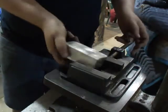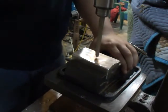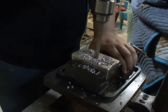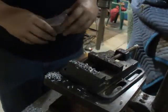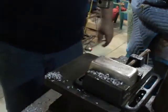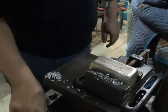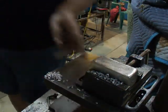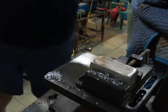On the bottom — I want a 1/8 inch one on the back and one on the front. This was 7/16ths, which is for the 1/4 inch NPT. Put that back away. For 1/8 inch NPT it is 21/64ths.